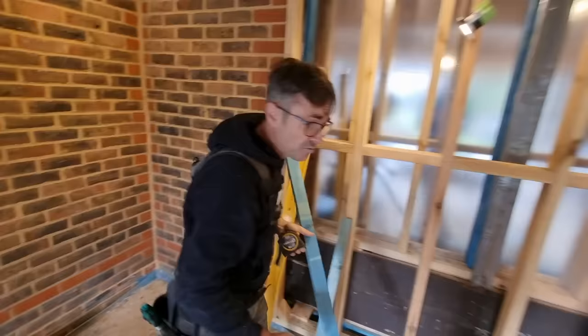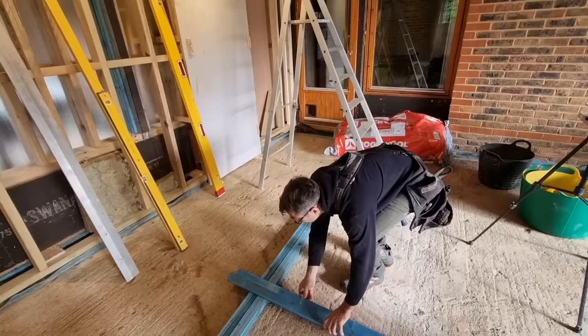We transfer the layout back to the floor — we don't need any benches to make this stuff. We'll have a top and bottom set out with a little square to keep it neat. We've obviously got one on either end, and then just something in between. We'll pilot those up for fixings — we're going to use 5×100 screws. They're nice and slim and you're not going to overdrive them and split the batten. Then there's the concrete screw — we'll drill a 6mm masonry bit straight through the batten in situ, into the wall, pack it, and screw through.